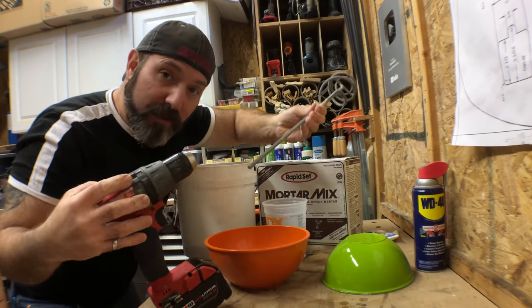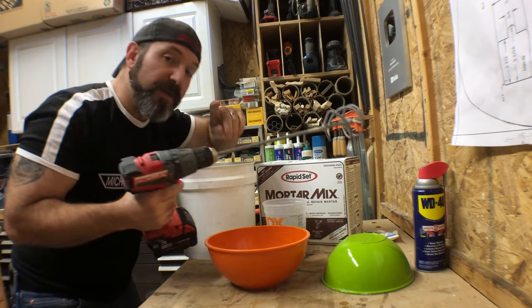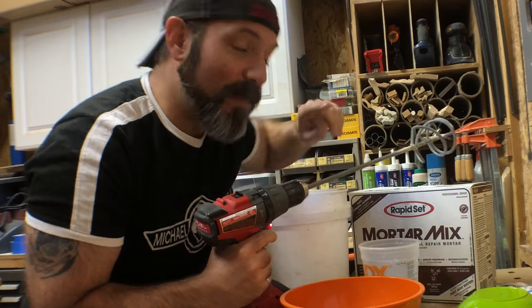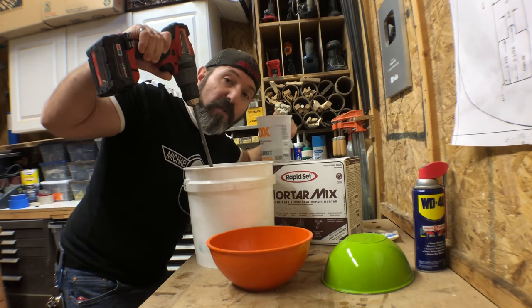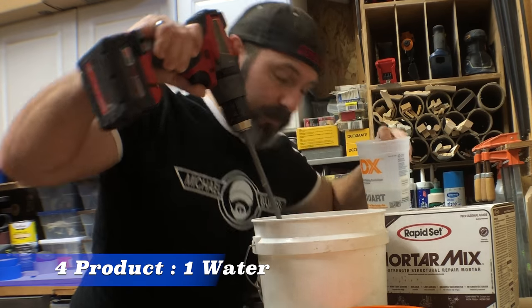Hook up our drill to our little paint mixing paddle. Don't forget to turn your drill down to low speed, high torque. Made a mistake in the last video with that. Thank you for making that comment, sir. We're gonna go for a peanut butter consistency. 4 parts product to 1 part water.